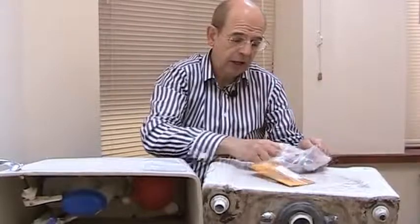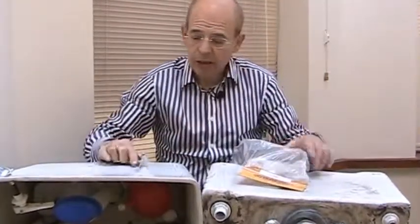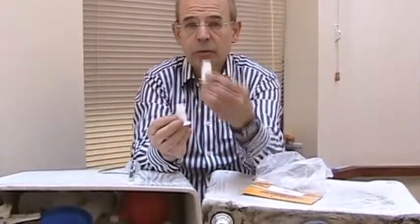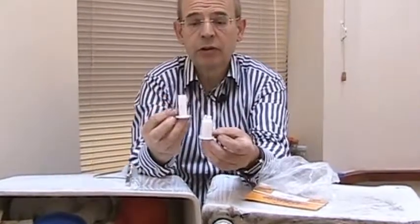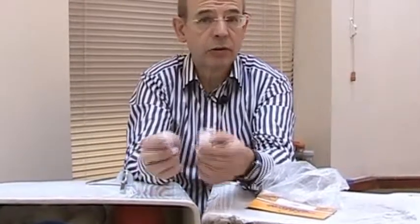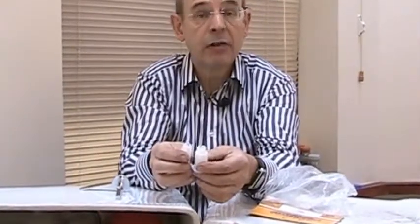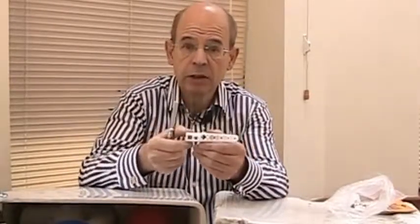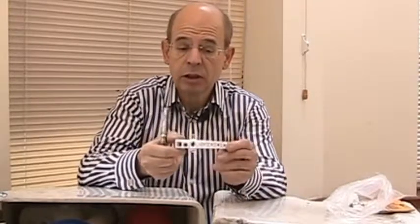The third kit they have is called an X-type and as part of this kit they have what's called bushes. That's the one you need for a 20mm hole and that's the one for a 16mm hole, so with this particular kit you can fit either hole that you might have. Two little points: if your handle is in good condition and you can unscrew the screw here it might be easier just to unscrew that and slide it off instead of taking off the ceiling. The other thing is you might be able to get the plastic handle separate if you want to keep your handle, but generally it's easier to just purchase the whole handle set and you get everything that you need.